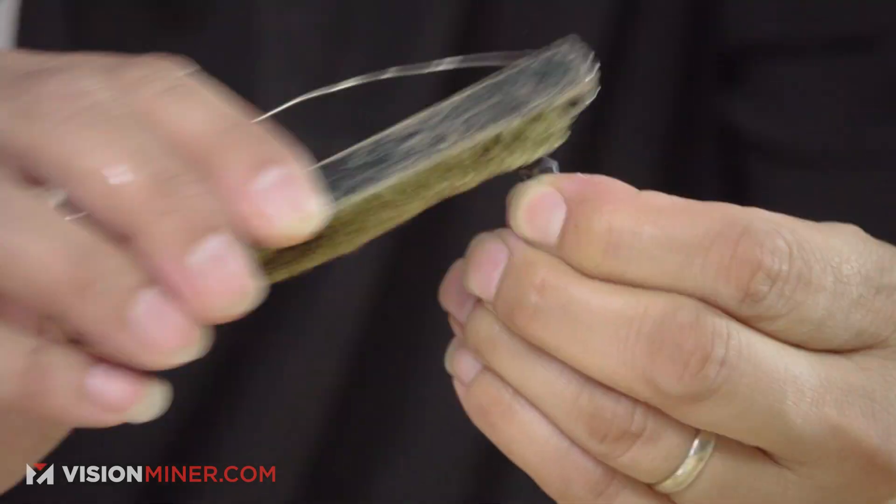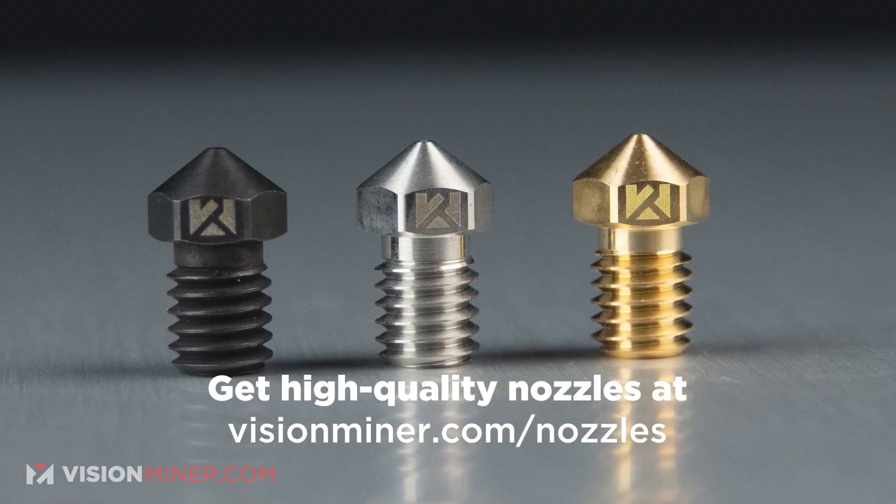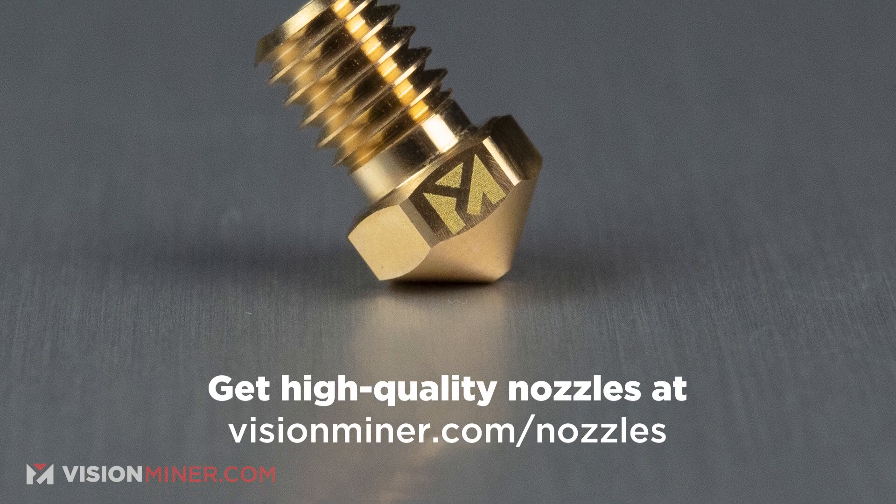You could burn it out again and drop it again just to get any extra material out of there. Optionally, you can use an ultrasonic cleaner, which vibrates water at a really high frequency and helps get any extra gunk off. Most of the time, that's all you need — you're good to go. Wipe it off, dry it off, stick it back in your printer, and start printing again.